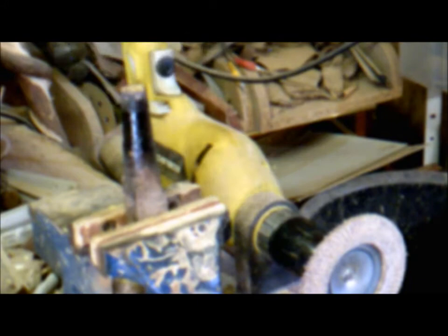Right. On these dollies I'll just make it a bit 1x1, I'll chuck it in the lathe. Just taper it down so that I've got 20mm here and then up to about 28-30 down here. The pipe will then just go on and jam on. And like that, I can then get in with the file until such time as I've got the shape and everything that I really require. Probably not the best of systems, but it seems to work for me. And it didn't cost me anything.